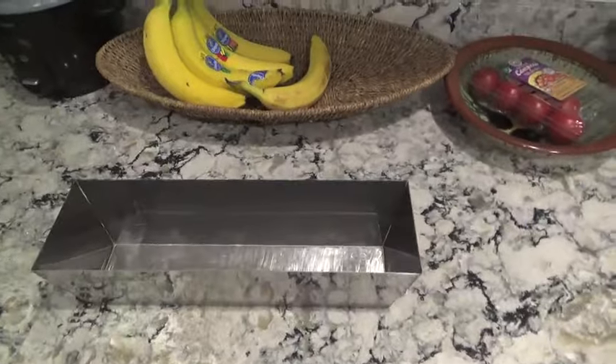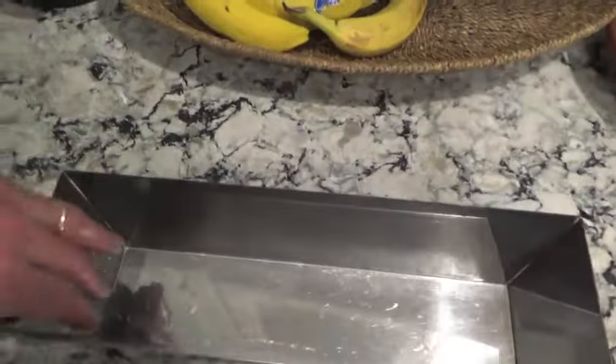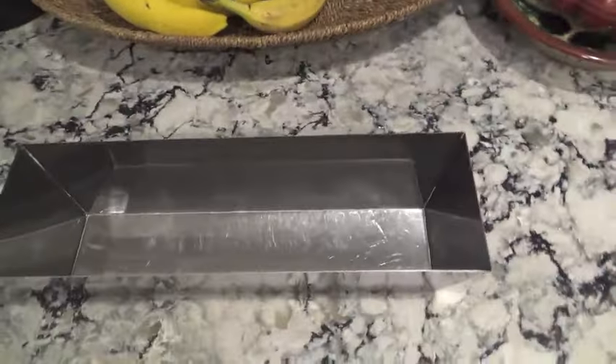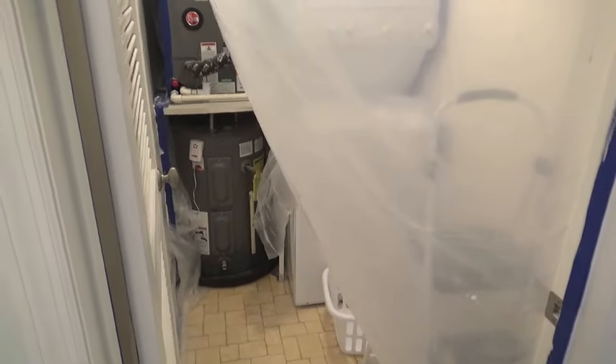Initially I tried mixing the plaster in a pan which I use for regular plastering, but I found I couldn't get the water from the corners that I'd added. It actually seemed to mix better in this open pan arrangement than in the much more narrow pan for plaster. I'm using a small fan to circulate air inside the laundry room to sort of speed up the drying of the ceiling. And then once I'm done, I'm going to put a coat of paint on the ceiling and then I'll be taking off this masking from the side walls because I still have to put a second coat of paint on the walls of the laundry room.